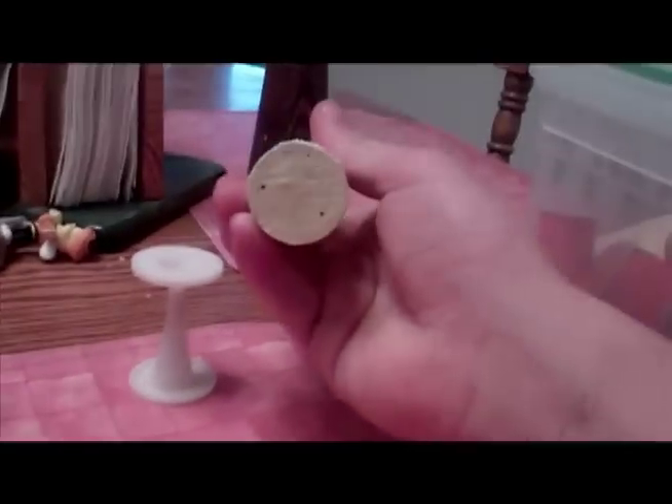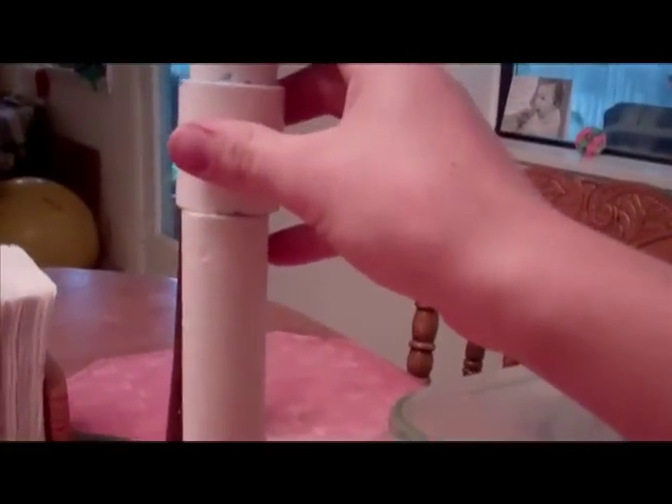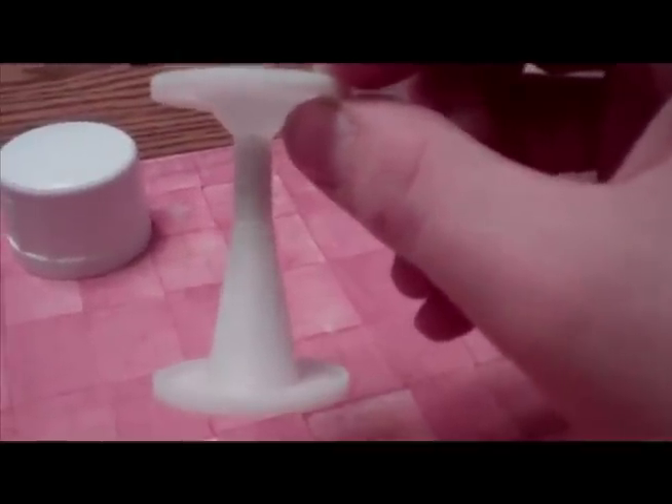Here's our 10-inch R-candy motor, almost ready to assemble. Just waiting on the putty to dry on the opposite end. There's the nozzle with a 1-inch PVC coupler to go right on top of the motor. We made our convergent on the inside and our divergent nozzle mold with this right here — it's just a CAD drawing turned into a 3D-printed object.